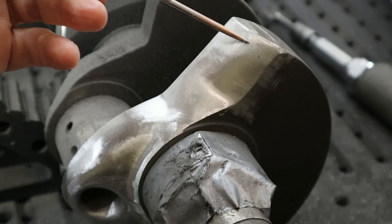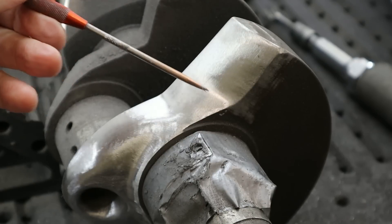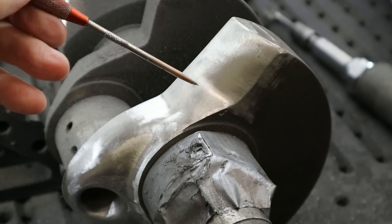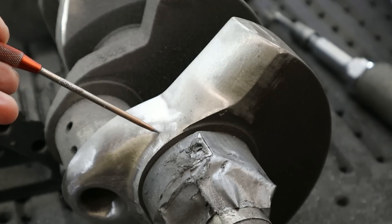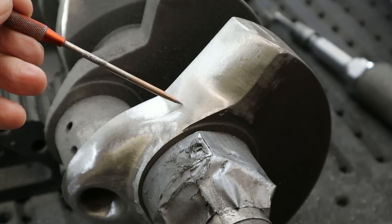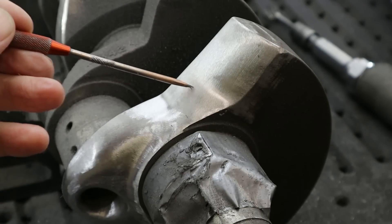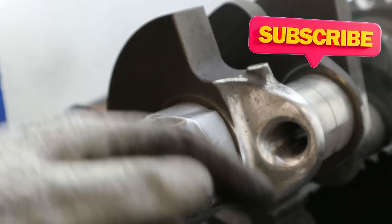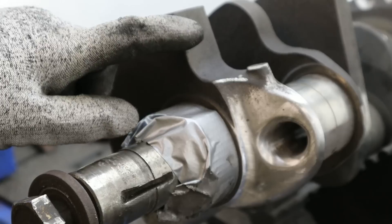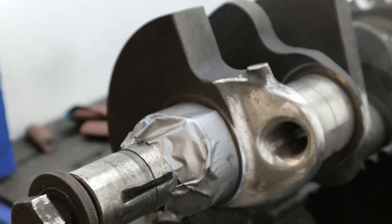As you can see, the windage radius is mostly on the outside third of the weight. I'm measuring it from here because this is going fastest. But I've taken off quite a bit of metal here because it's just along for the ride, and that's going to help a little bit as well. Notice how it's blended in here and no humps there — so that's your target. Now I'm going to tackle the other side of this throw, shape all this as per this side, and start on this side — which is the side that will be cutting into the air, so it is more critical than the side we've just done.